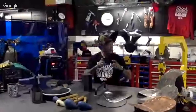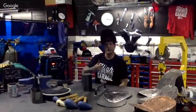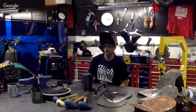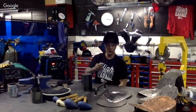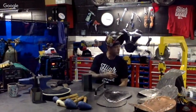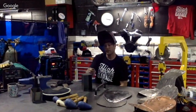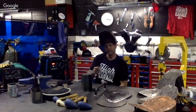Touching on grinders, take a step back on this one. The higher number you have on grit numbers is the finer type of sanding tool it is. So when you're first starting to bring down your welds, if you have a larger weld and it's not flush, you want to use a lower grit. For instance, in a 36 and 80 grit we have right here. So I would use a 36, start bringing that down, work the metal down, and then start jumping up to higher grits to get a nice final touch.